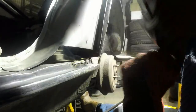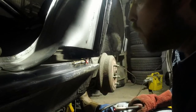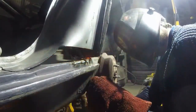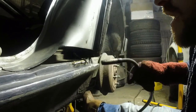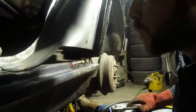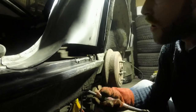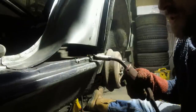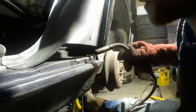You can tell it was wax oiled. Some of this I can actually weld from underneath if I need to. Just welded that bit from the back as well, because I want to sand that so it's nice and smooth - I want the extra material so I don't end up cutting through. It's a big void behind. Now to try and snot the top together.